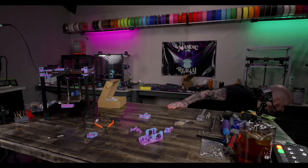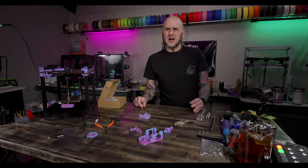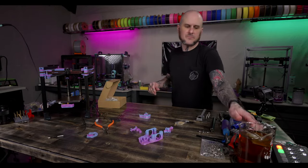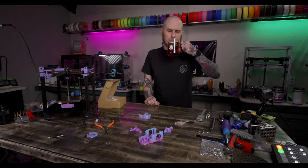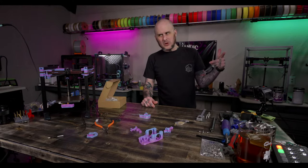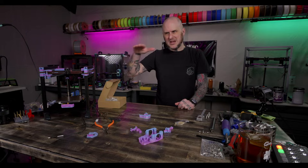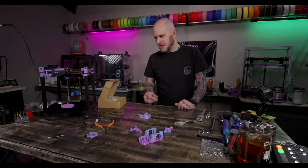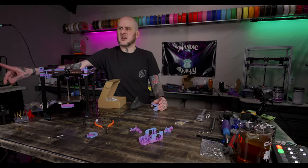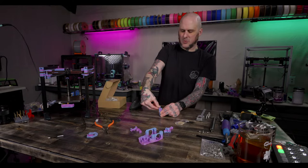So honestly, the Nevermore is going to do perfectly fine. I could probably run the Nevermore on the other side, by the cable chain. That's where the Z cable chain is. There's no room there. It has to be on that side. I could move the thermistor port, but then I have to rework the design just for that, and I risk the cable chain contacting it. I think it is above print height, but I don't know. I'll see how popular Zero Filter becomes, and maybe I'll retweak and make a Zero Filter version of my hex panel. But for my purposes, I'm just gonna go with Nevermore.